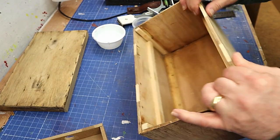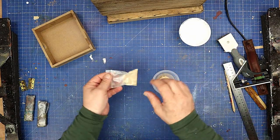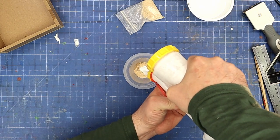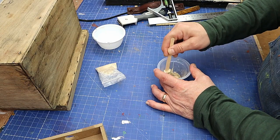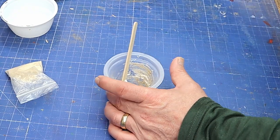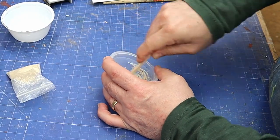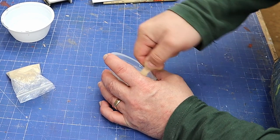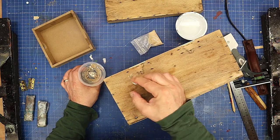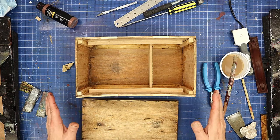I'm going to add a little partition in here, which I'll show you in a minute. I also need to fill a lot of these holes. The best way I find is to take the sawdust from where I've cut this, put some in a pot, and add wood glue to it until it's like a paste. Because this isn't going to be varnished — it's going to be covered — it doesn't matter if it's a slightly different colour. It dries lovely and hard; you can screw into it and it gives a nice smooth finish. Just run over it with sandpaper and you're done.